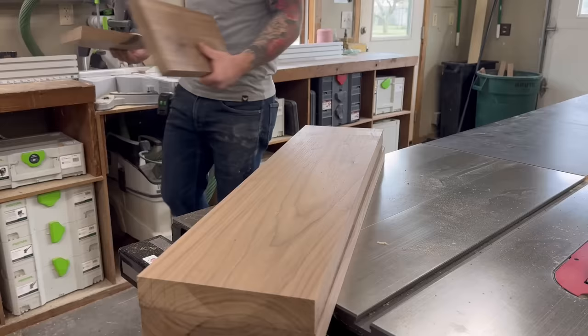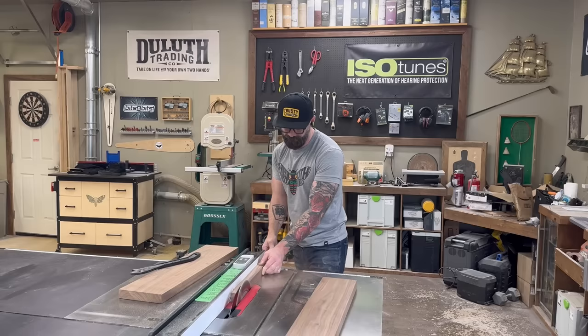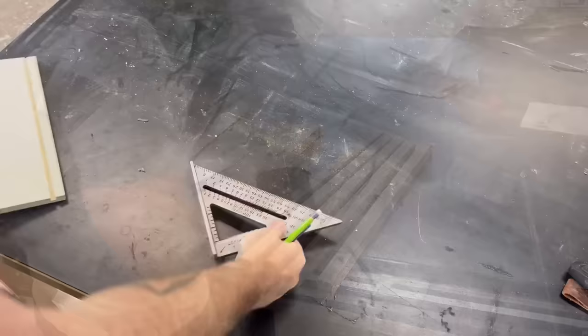Pretty much all of the pieces for this stool can be made out of solid walnut, except for the round stool top — I had to glue two pieces together for that. I figured I might as well do that right away so they could dry while I'm working on other things. I put them in clamps with a little bit of glue, made sure they were nice and straight across the top, and left those to dry. Then I went to the table saw and ripped down some pieces that were exactly inch and a quarter wide, giving me perfect inch-and-a-quarter by inch-and-a-quarter sticks that would eventually be stool parts.